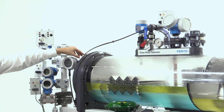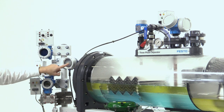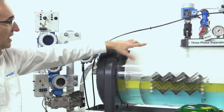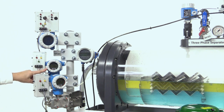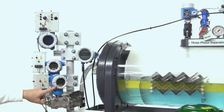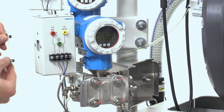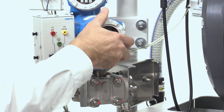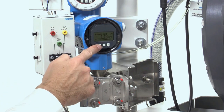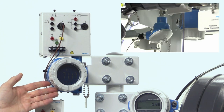This rupture disc is a pressure relief device that protects the system against over-pressurization. The signals of the oil and water levels are sent through this cable to a transmitter so that we can read the levels. This tube sends information regarding the vessel pressure to a transmitter which displays the correct value. The other transmitter is a differential transmitter that measures the gas flow rate via the orifice plate. Each transmitter is equipped with a connection box that integrates a switch for fault insertion. Students can also learn to configure transmitters manually using these keys and menus. This optional transmitter displays temperature and is wired to a thermocouple located under the vessel.